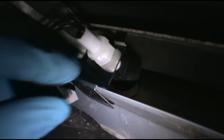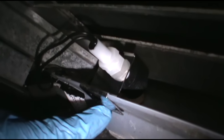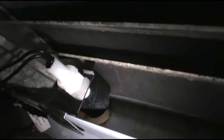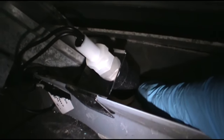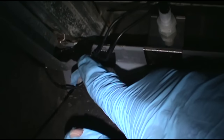Alright, dude's got it clipped on. That's it right there - it's easy. You just bloomp, clip it on the pan. You got to put a little man in it - it's got a little thing in there to make it where it won't pop up easy. But you just push real hard and clip it on. So when the drain line clogs up, the water rises, water rises, boom - pushes that up, shuts the 24 volts off, shuts the system down. I took a sticky piece of ArmorFlex tape just to get those wires out of the way. Ran it behind the filter rail here.